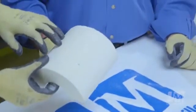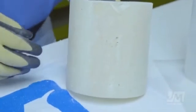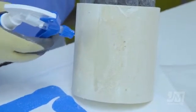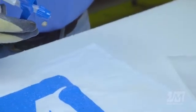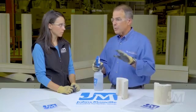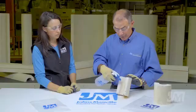Can you show me the difference between Thermo 12 Gold and Thermo 1200 when it gets wet? Absolutely. So this is Thermo 12 Gold, the legacy material. I'm going to spray it with water. You can see it doesn't even run off — nothing's running off. And this one is Thermo 1200 — it beads up, and pretty much all of it's running off. I'm asked often when I do this demonstration: what about the inside diameter? Is that water-resistant as well? Remember, this is integral to the chemistry of the product, so it's throughout the material. It's not a surface treatment, and you can see the water running off the inside diameter as well.